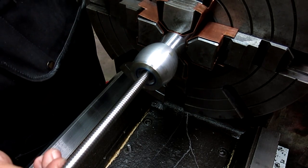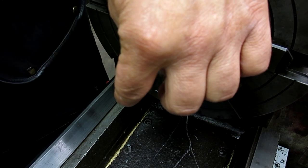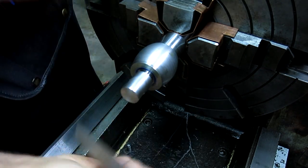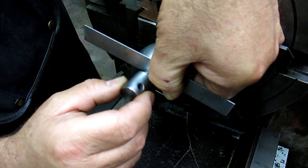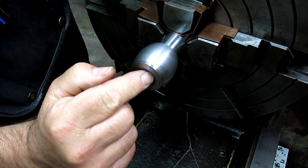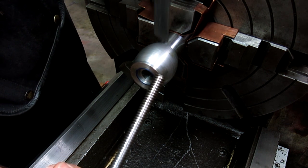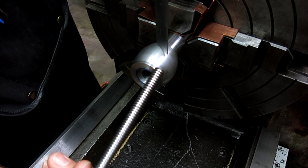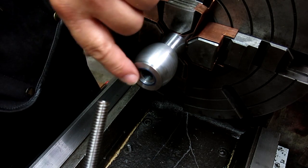There's a mile of clearance on that. Feels fine. Let me do a little check — holding my scale flat against that surface. I want to just feel that it can turn freely, and pushing and pulling on it there's not much wiggle. Let's break those edges a little bit. There's some mill work but I'm going to wait on that until I weld the jaw onto it — the jaw gives us an orientation, and it's a lot easier to do accurate hole placement after welding than to do accurate welding with the hole placement first.